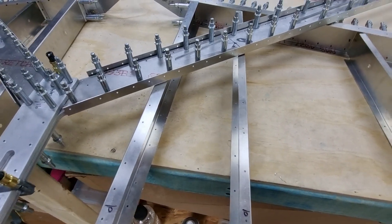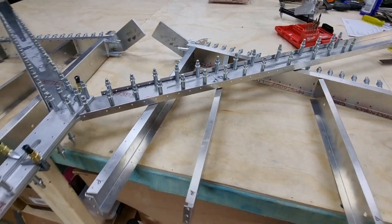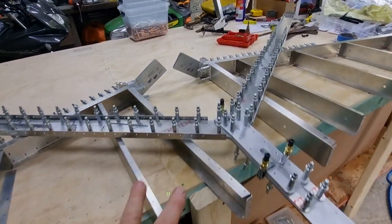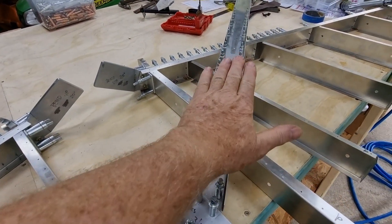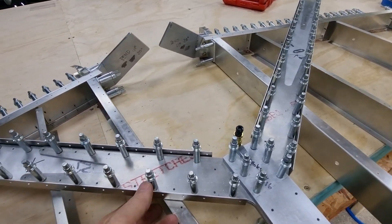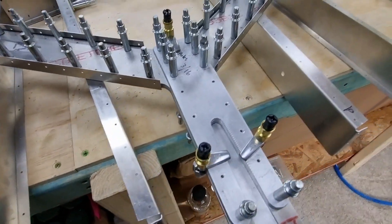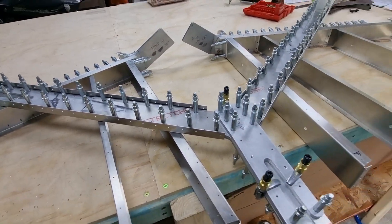Looking at this drawing, it's probably clear — this is built with the forward spar on, not the rear spar, so you're basically building two independent stabilators. I can't really see it being an issue if I disassemble these structural spar elements off the rear spar of the stabilator and fit it to this, having effectively two independent stabilators. I believe that's the way to go — that way I can dry fit the skins to each of these while clecoed, just to be double sure that things line up. I'm not concerned, I think the kits are brilliant, but it's a way of triple checking.